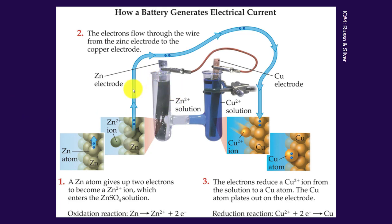Taking a closer look at the zinc side: zinc likes to oxidize from neutral to a 2+ charge. The neutral zinc is in the piece of metal — the actual electrode — and the zinc²⁺ is in solution. At this electrode, zinc will leave the metal and start floating around in solution. So as this battery runs, that zinc electrode will start to deteriorate as the zinc ions go into solution.